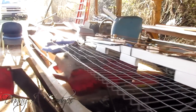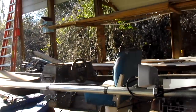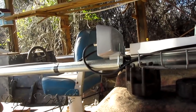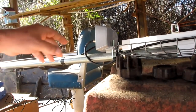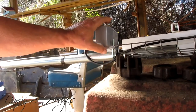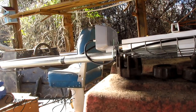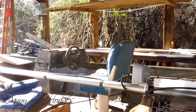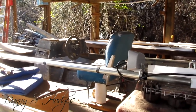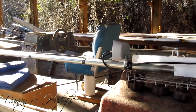Here's an antenna that I got right here — I took it off the truck because I keep one ready all the time. This is something I had told y'all and ain't started doing, but I about think I need to start doing it: taking your booster box and putting it down the pole, way down the pole, to where you ain't got to lay the antenna down if you need to swap the booster out — because they go out every now and then.